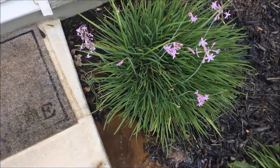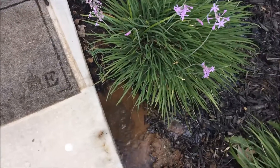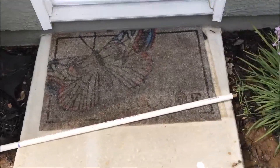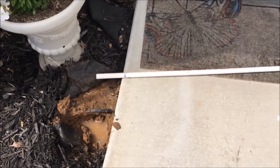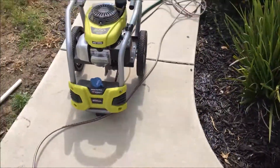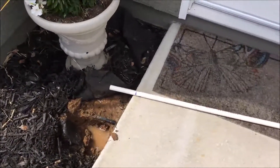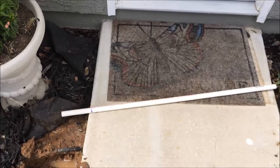What I'm going to try to do is wash this 3/4 inch PVC pipe underneath there and then run a new line. I have cut this PVC to length. What I'm going to use to wash underneath the concrete is this — it's called a clog hog. It attaches to the pressure washer. I'm going to see if this works — it's a new toy we'll get to try out.